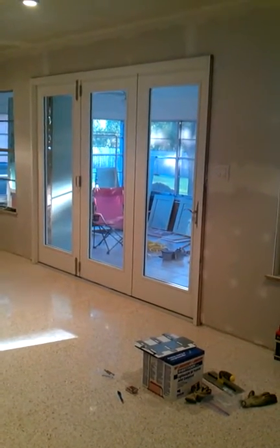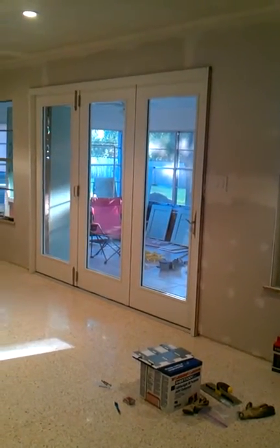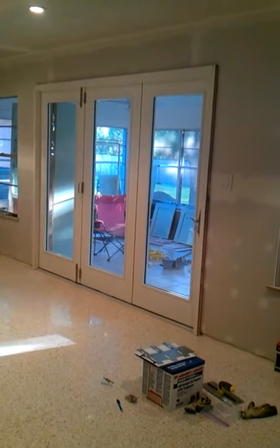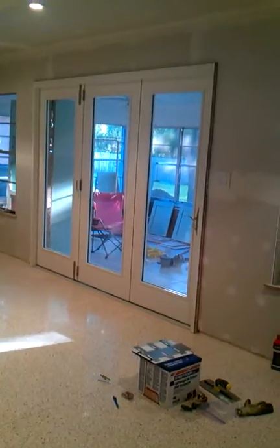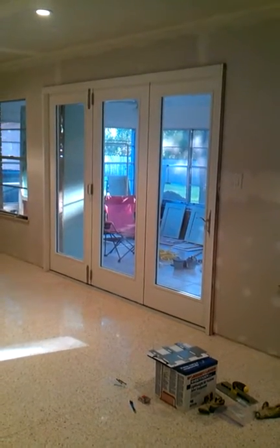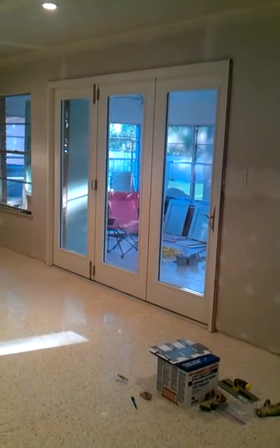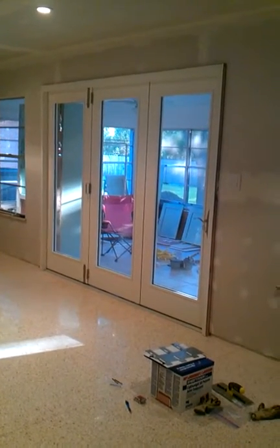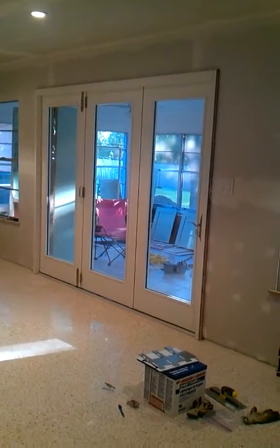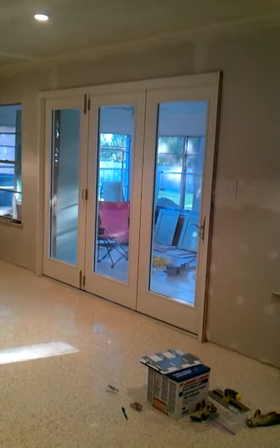Review of a Jeldwen Aurora fiberglass folding door system. The door is a retrofit in a 1960 ranch-style home in Texas that separates a living room area, fully indoors, from an enclosed porch that is glassed and screened in — somewhat of a three-season room. It was installed to replace an eight-foot wide aluminum sliding door with original plate glass. Four feet of moving plate glass is heavy, aluminum is soft, and it had worn a groove in the channel. The door was heavy to move, the locking mechanism had broken, so I had a hard, heavy, dangerous, unsecure door that was replaced by this Jeldwen door.